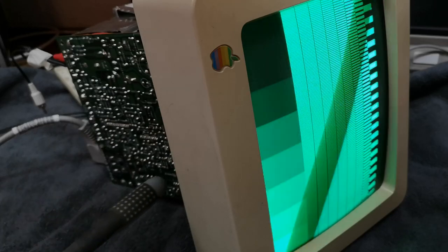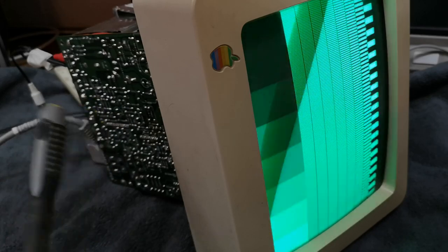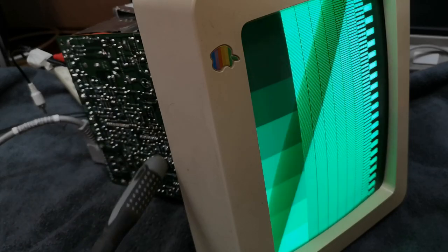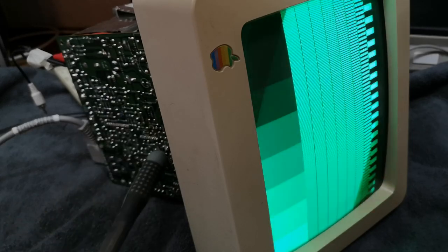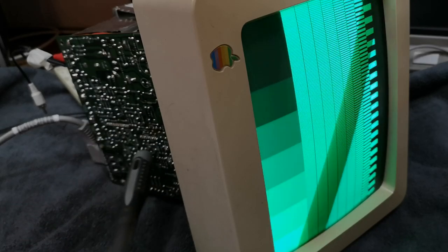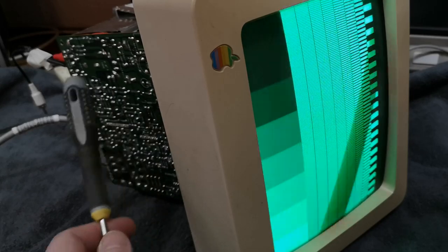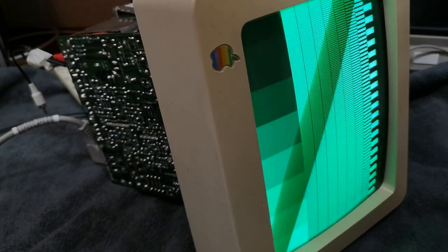But I went through all the solderings, more or less all the way around the PCB. And I did this soldering while massaging with my soldering iron. So I was scratching a little bit on both the pad and the pin on everything here while I was adding new solder and all that kind of stuff. And look at that. Now I can't recreate the problem. So it was just a re-solder job. I don't know how hard I need to hit. Probably not gonna create a new loose connection, but look at that. It is just super, super stable now. Winner, winner, chicken dinner.